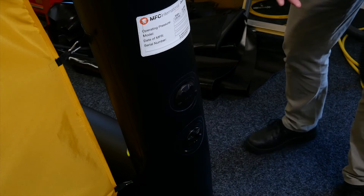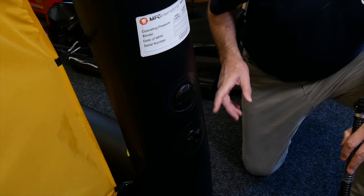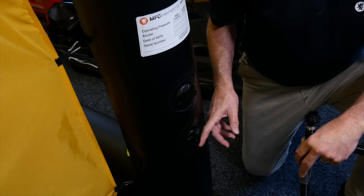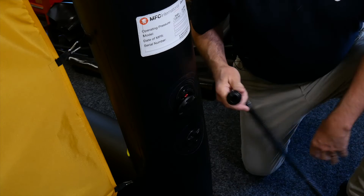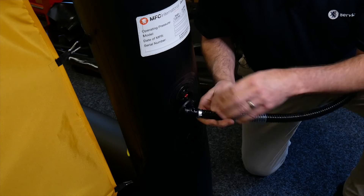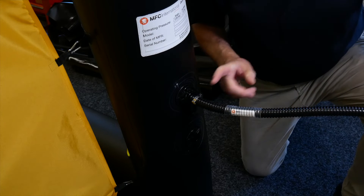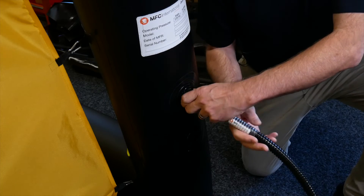Just a few words on inflation and deflation. It is always best to inflate the shelter from the end where the relief valve is — that way, as you inflate it, you can hear the relief valve operating. The inflate/deflate valve has a cap on it, and the hose connection has a threaded end, so you need to insert it and turn it to pick up the threads and lock it in place. I'd like to show a close-up of this valve so everyone understands how it works.